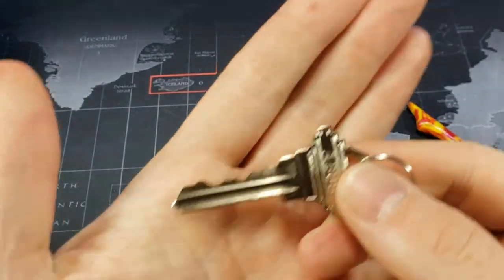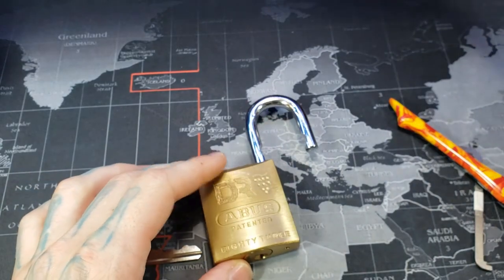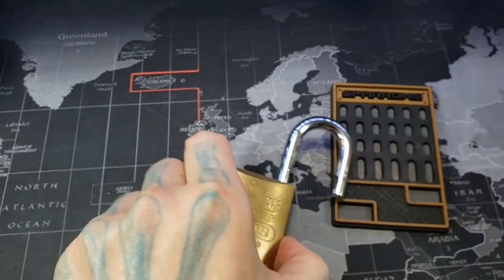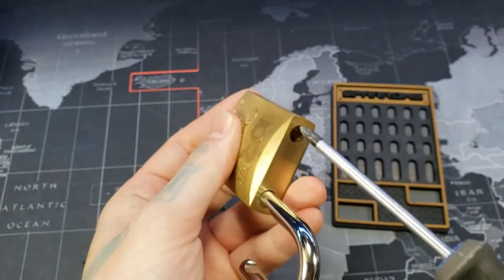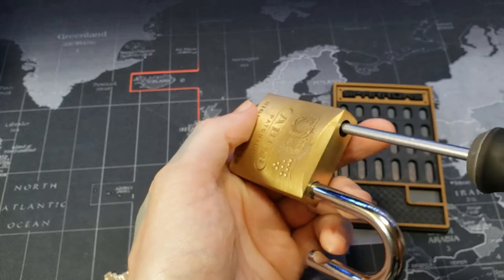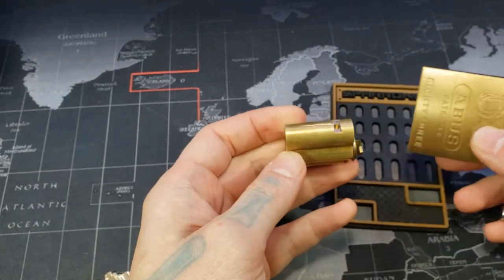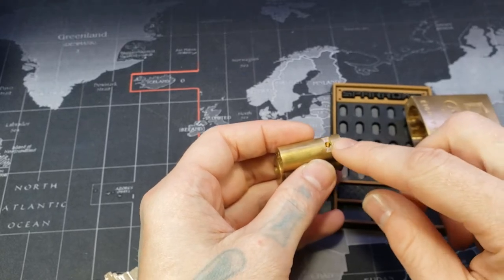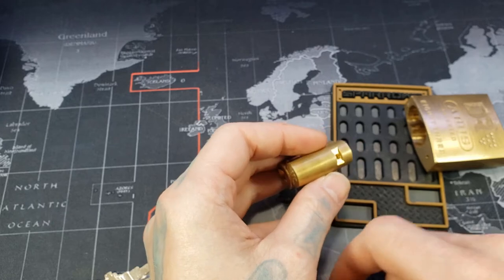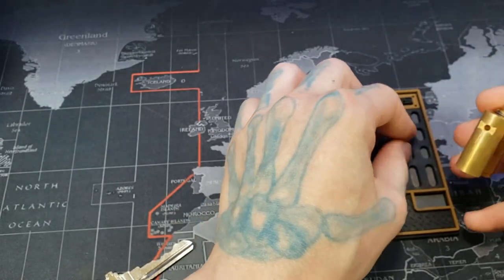Our key is behind there. There's our bitting - pretty good bitting. I'm trying to move all this over, follow it out, and get the Phillips head. They said the sixth pin area didn't have a cap on it for whatever reason, so I'll put one on it. As you saw, our spring went flying somewhere, but that's okay - I'll just replace that. Oh wow, look at that - that's nice looking.